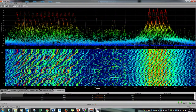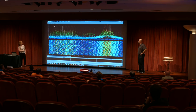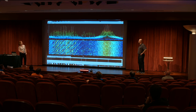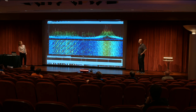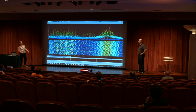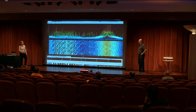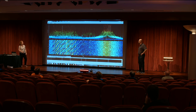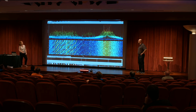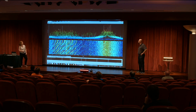So I can see here my two wireless DMX systems, and you'll see they're sending short, intense bursts of signal. As opposed to, we have another guy hanging out over here. I think this is either our mic or our wireless Wi-Fi Ethernet. And you can see this is the spread method. So you see there's kind of a peak in the middle, but then it spreads across, as opposed to our frequency hoppers that have these big sudden peaks.